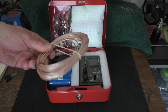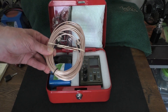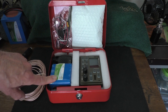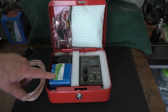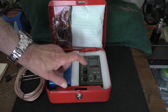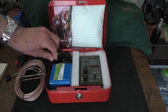I have 25 feet of RG-316 coax here — low-loss for a thin cable, though still lossier than thicker cables, but very portable and light. That gives us a way to reach the antenna from the transceiver. We also have a Bioenno 4.5 amp-hour battery in here, which will give many hours of operation with this radio. Also included is an external microphone — though the radio actually has a built-in microphone and a built-in speaker, so we don't need a separate speaker.